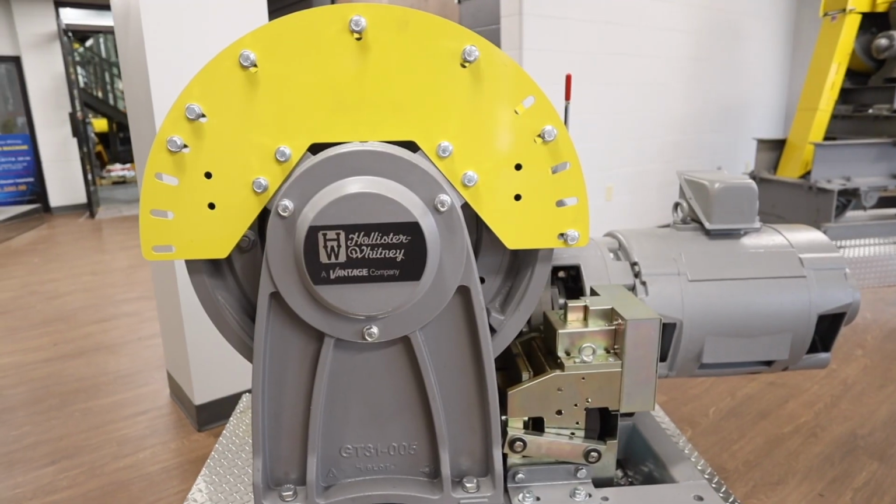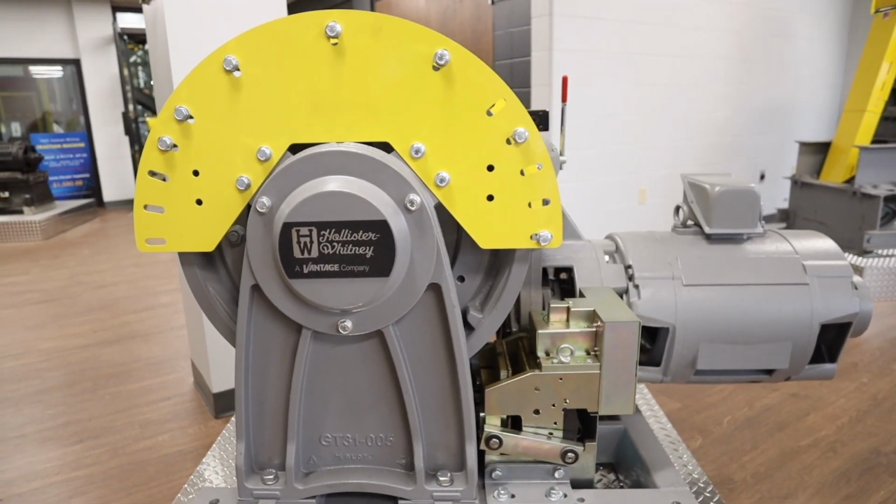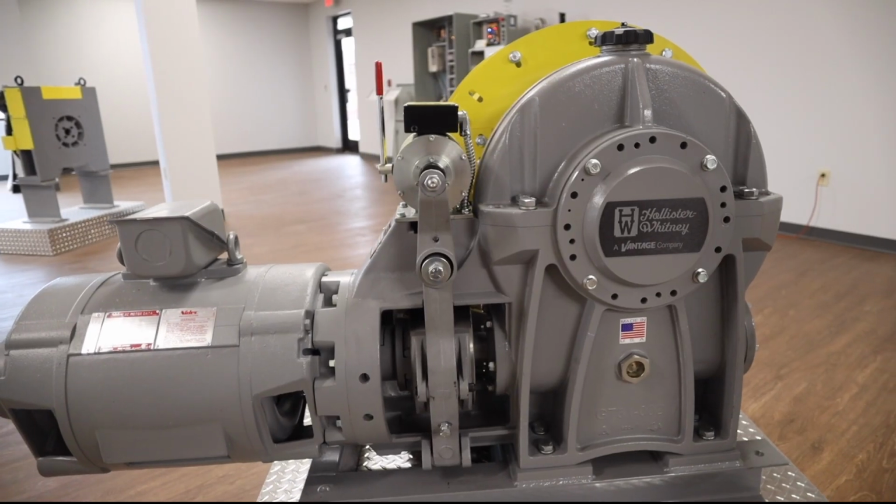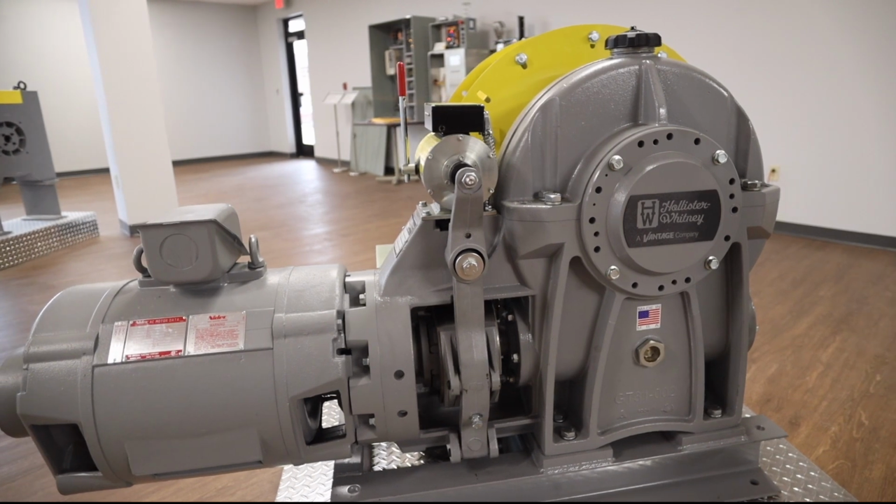After the machine is fully assembled, recheck the gearing backlash and pattern through the inspection port. Be sure to add oil into the machine and fill it to the proper oil level before putting back into service.